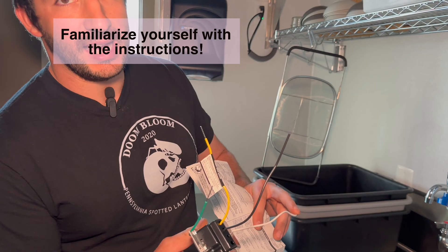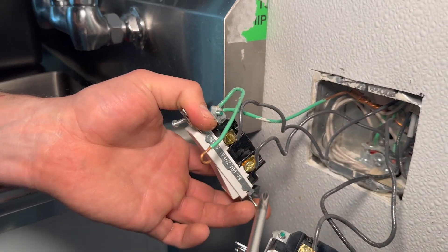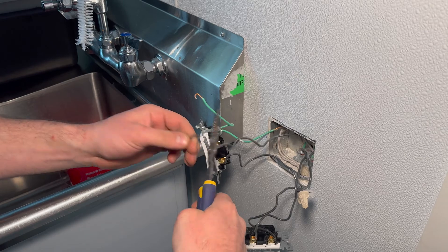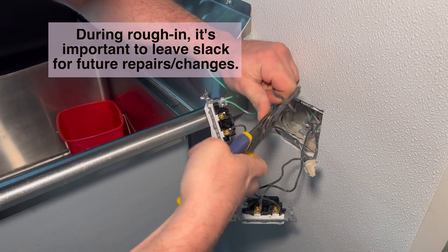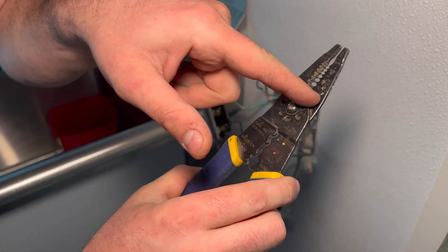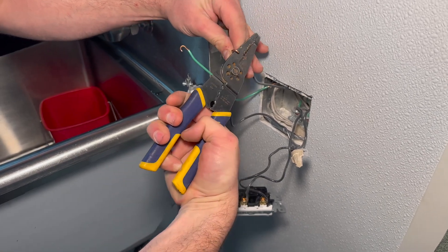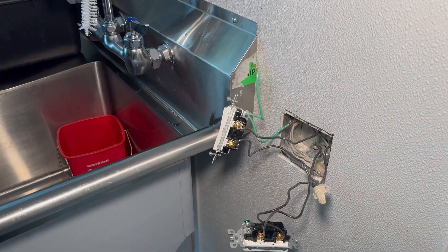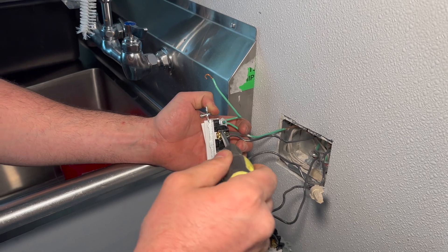This neutral needs to be tied in. There was a short at some point, so we're going to cut that out. Shorts like this are unfortunately too common — that's why we tape all of the exposed brass and screws. A little hook on the strippers is usually for making a hook.